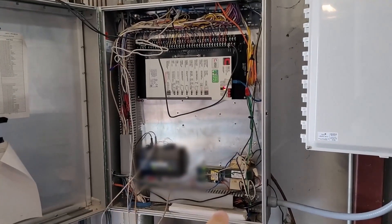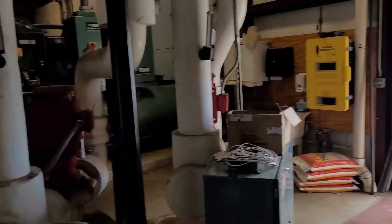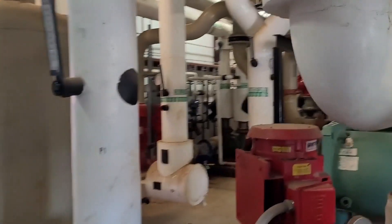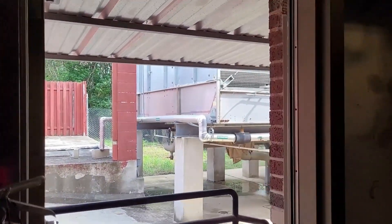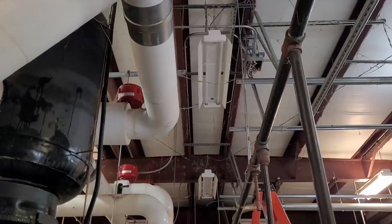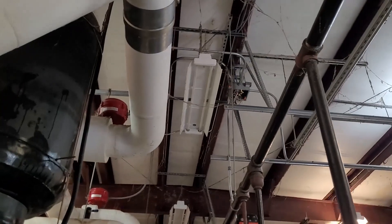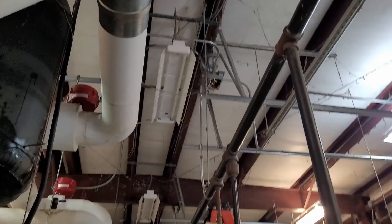Once the ECY is installed and I can verify remote access, I start putting things in hand. I've got chilled water pumps — primary and secondary — condenser water pumps, and cooling towers; all these fans and pumps need to be in hand during the switchover so the loop stays cold. For example, there are two relays controlling isolation valves — two out of three — and both relays are lit, meaning two of those valves are open.